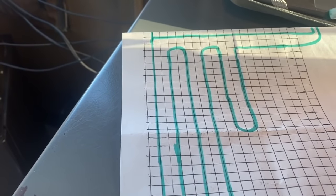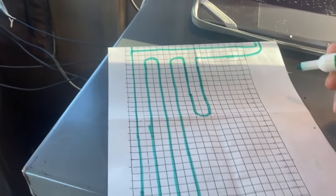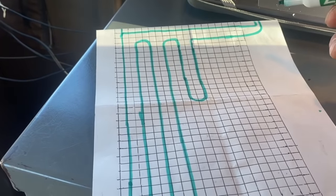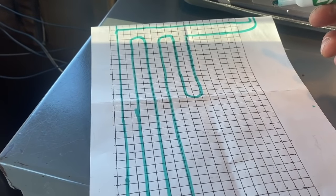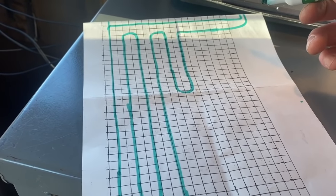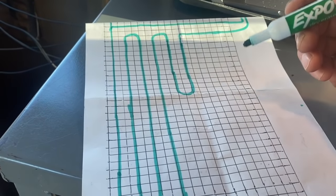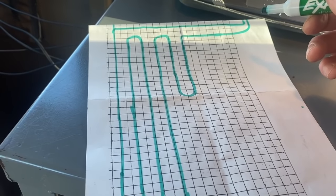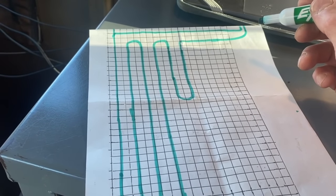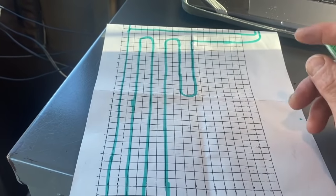And we got a 1,200 foot area. So we got exactly 400 foot. Because what I'm going to say here is, the most important part is to try to get these loops all the same length so that your system will balance itself out. Because water will flow equally if all your loops are the same. It's thermodynamics, guys. Resistance to flow, like I said, head pressure. If you keep all these loops about the same length, the water will flow evenly. You won't need to spend a ton of money on balancing valves and special headers and stuff. You can just make up a copper header and your water will flow evenly in all your loops. So let me show you how we would handle the second loop, the next 400 foot loop.